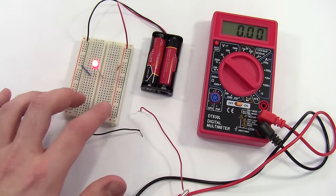There are some more advanced features on this and other multimeters that we didn't cover in this video — like the NPN/PNP transistor measurement, and the AC voltage setting (V with a squiggly line) for measuring alternating current from a wall outlet. We don't recommend measuring wall outlets if you're new to electronics, as they are dangerous. Battery-powered circuits are generally pretty harmless and safer if you're starting out. If you have more questions, check out our written tutorial linked at the end of the video, and have fun using your multimeter in your project.